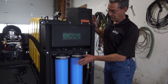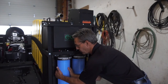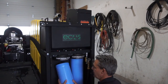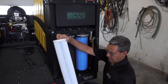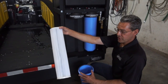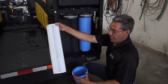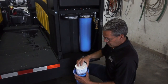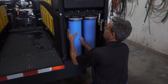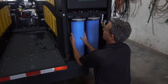At the back of the ECOS 7000 wash unit there are two filter cartridges: a 50-micron mesh cartridge and a 20-micron mesh cartridge. Prior to operation, the operator will need to remove the canister housing from each filter and insert the filter itself. These can be removed, washed, and reused several times before replacement. Simply unwrap the clear plastic wrapping off of the filter, insert it into the center of the bottom of the housing, set it below the cartridge top, and put it in hand tight.